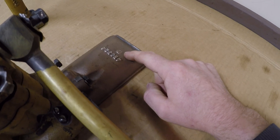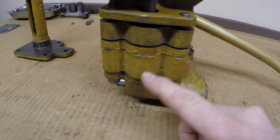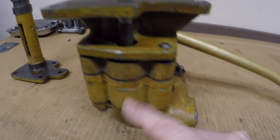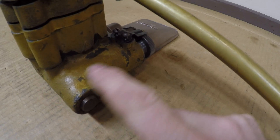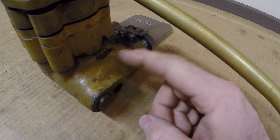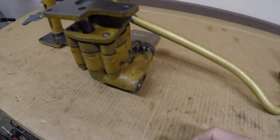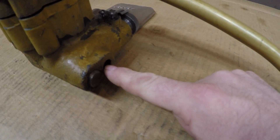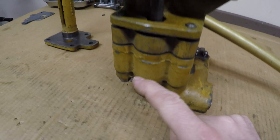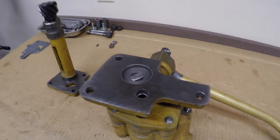The auxiliary pump exhausts oil around this standpipe and it just runs down the outside of the pump. The primary pump gears are down in this lower section, and the primary pickup screen — which is all in the main sump of the oil pan along with the pump itself — draws oil in. Your primary pump gears create pressure. Oil under pressure is fed into this chamber here where there's a pressure relief valve, a spring, and an adjustable thumb wheel. You adjust the spring tension on the poppet to get around 30 PSI on a warm engine at normal operating speed. Any excess pressure is exhausted out this hole into the main sump; the rest of the pressure goes up this standpipe and on its way to the rest of the engine for lubrication.